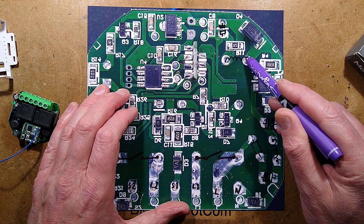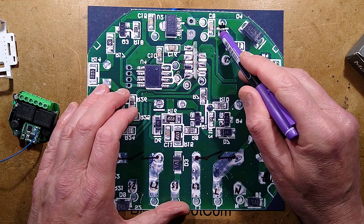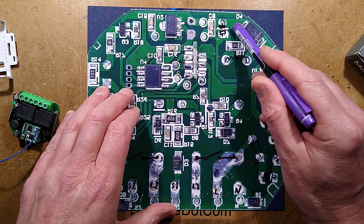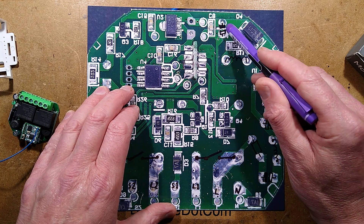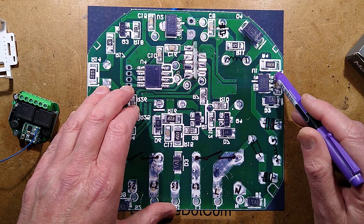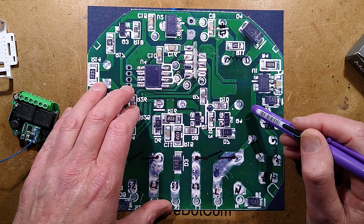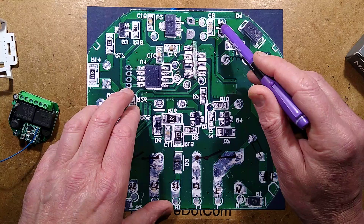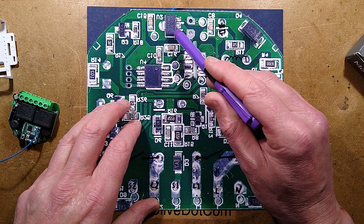When this powers up the inductor, initially as the magnetic field builds up it creates resistance to current flow, and that is used to charge the capacitor on the low-voltage side to 5 volts. When it turns off, the magnetic field collapses, goes through the freewheel diode, and still pumps the capacitor up - efficiently using the build-up and collapse of the magnetic field to charge that capacitor. This chip will have a built-in voltage reference of 5 volts - it's a dedicated 5-volt chip. Associated with this are a diode and capacitor probably for its own supply, and a sense resistor of 0.3 ohms. The 5-volt supply has a decoupling capacitor, then goes to a 3.3-volt regulator with another decoupling capacitor, generating 3.3 volts for the circuitry.